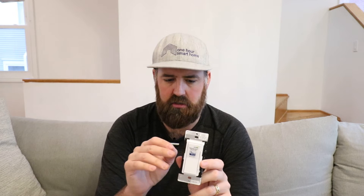At the time I had automated my whole house with Z-Wave light switches, and there's stuff in the programming where you can see if they're repeating the signal - they all repeated the signal really well. I never had problems with any of them being too far away because the Z-Wave system creates a mesh network. Each switch will communicate commands to the other ones and the hub, and it will relay those commands. That is the nice thing about Z-Wave switches.